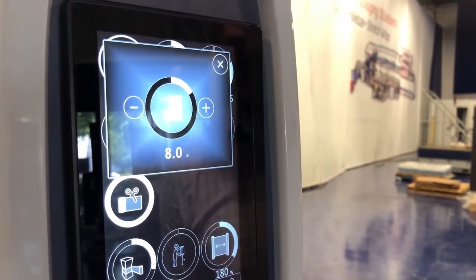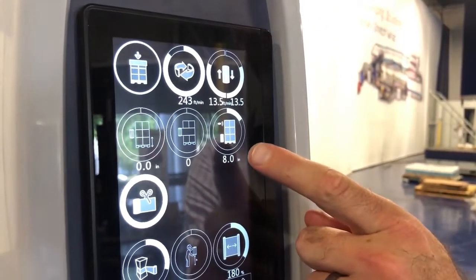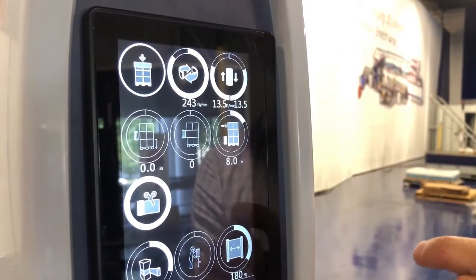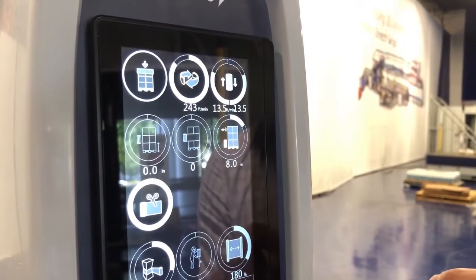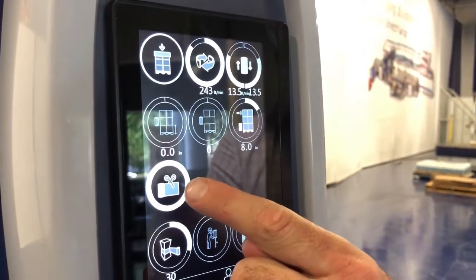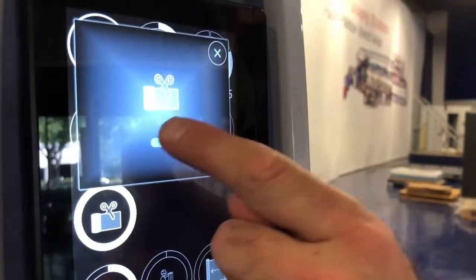This is our photo-eye delay. When you have this on, you are telling the robot's photo-eye to wrap eight inches above the top of the height of the pallet being wrapped. We also have the auto film cut, which is standard on our robot and can either be toggled on or off.